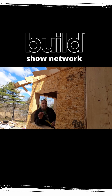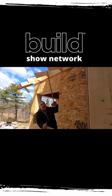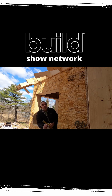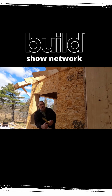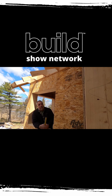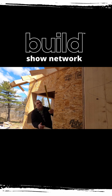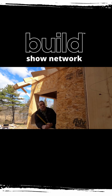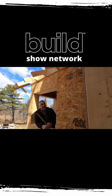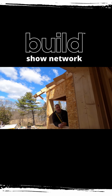It's always a big question to ask up front, because if we just went and designed this and said, hey, we're gonna have this really cool square cut fascia out here with some really nice stuff underneath happening in the soffit, and then the homeowner says, okay, well, can we put gutters on the house? Well, we're at a little bit of a loss. I'm gonna jump in that window over there because we have a soffit right behind the camera that's under construction, and you'll be able to see how that goes together.